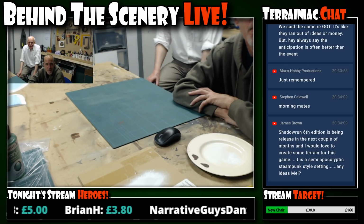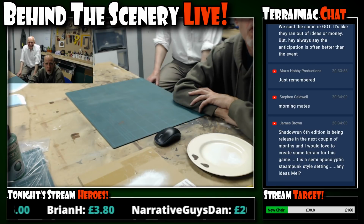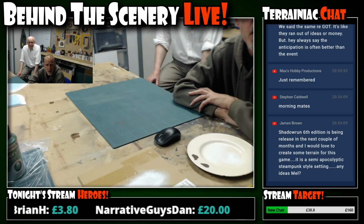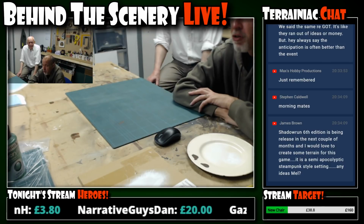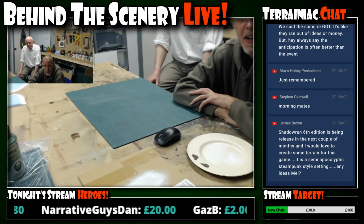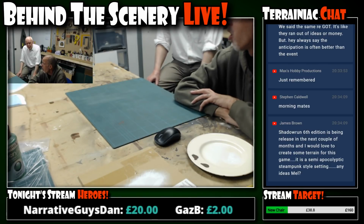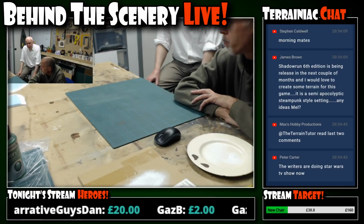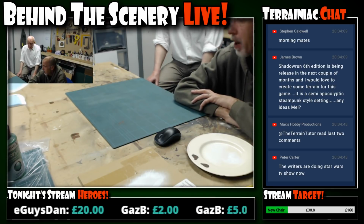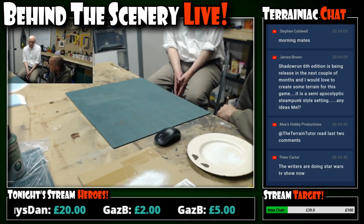That's very true. It's olive oil and water. No, that won't fix it either. I mean, the problem with frosting is moisture is trapped inside a hard coat of varnish. Yeah, you can do little tricks like re-varnish and try to get rid of the frosting, but fundamentally, it's in there. Rubbing stuff on top of it isn't going to change that.